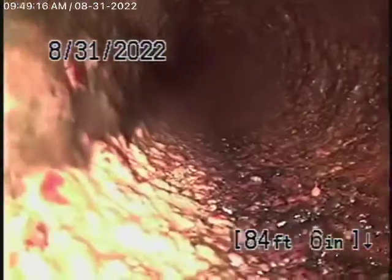I would definitely be a little wary about hydro-jetting this line for two reasons: it's such a long distance downhill, and the roots have actually gotten into a cast-iron pipe. Coming back here, you have ABS plastic for the rest of the way, which is all in good condition. To hydro-jet a cast-iron pipe could very possibly break it, so it wouldn't be a good idea to hydro-jet this line 150 feet away going downhill.